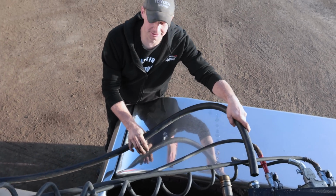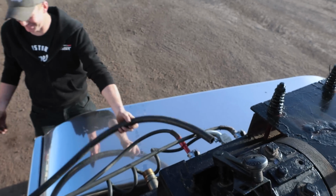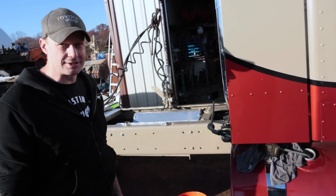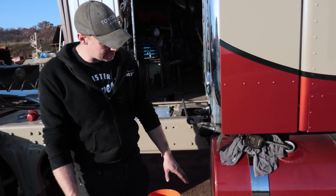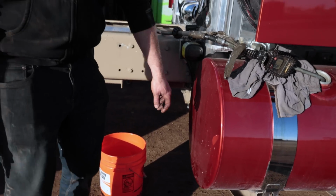Yeah, actually, that's perfect. No shorter. Okay, so filling the tank. It was clean, but I just filled it up a bit, cracked the hose, and made sure the oil was nice and clean coming out, so we're good in that aspect. The tank is tilted up a bit too, so the suction is right about here, so all the crappy oil sits at the bottom.